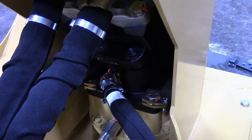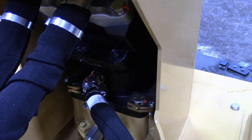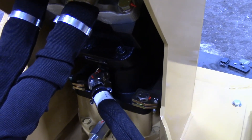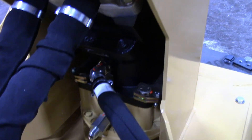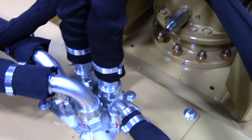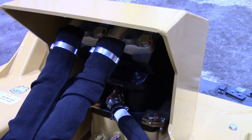Our standard motor is a gear motor which provides plenty of power and is very simple and easy to maintain, protected from excessive pressures by a pressure relief valve. What we have on this unit is actually our optional bent axis piston motor, which features increased efficiency meaning less heat buildup as well as increased pressure capabilities. If you're not sure which one is going to work best for you, talk to your Diamond representative or local dealer.